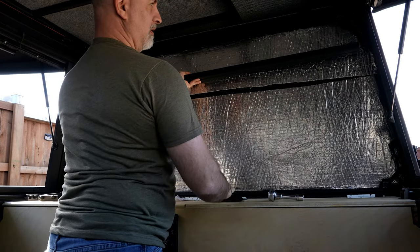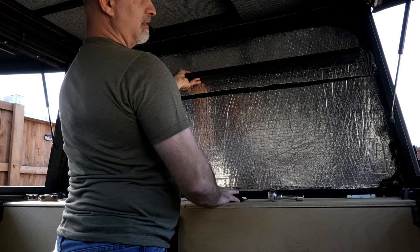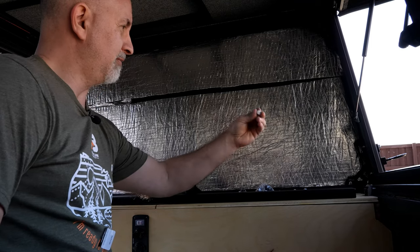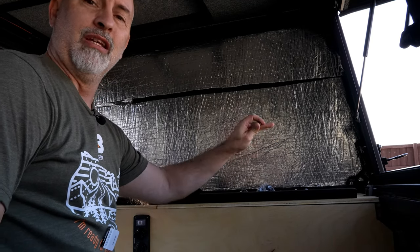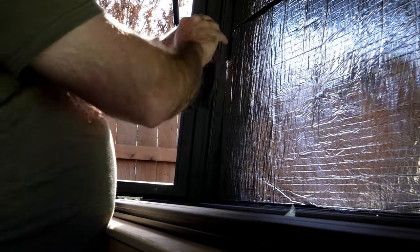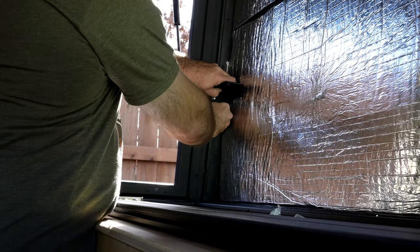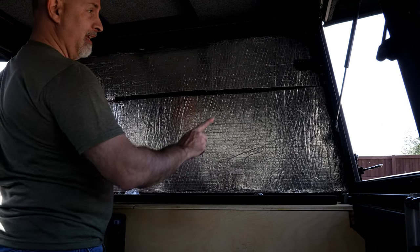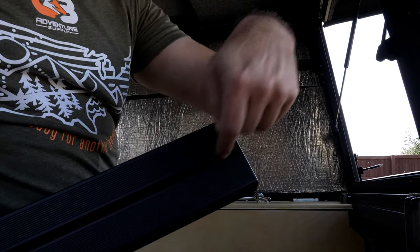With these brackets, this bar will hold the top of the tank in place, and then the tank will fit right in here. Get those bolts in place, get these brackets in place, and then fit the water tank in and adjust everything together. Get the nuts and screws in the holes — you have to remove the two bottom brackets first so you can access where the bolts go in. When putting in the brackets for the bar, put the big slot up and the three holes against the panel, then slide bolts in to line them up. Washer, washer, washer, and bolt. Once both brackets are in, set the bar on, tighten it a little, and then put the water tank in to adjust for a snug fit. To get the screws in, these end caps have to pop off.